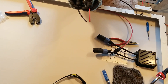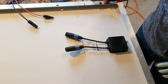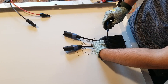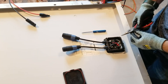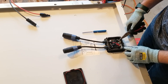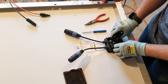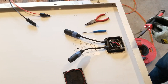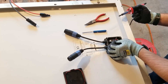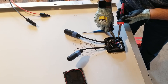I'm going to strip these ends and add some solder to them, pop this open and get it ready to put in there. The soldering iron is hot. I'll use my little flat head, push it in and pry it out. There are two reds connected to the positive side and two blacks connected to the negative side — this is how they keep it in parallel even though the panels were stringing together in a series style. To get these off I just take my soldering iron and push right at the base of the cable and it pops off. You can also use the needle nose — a little back pressure, a little up pressure, give it a second, start melting, and there it goes.